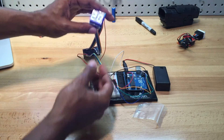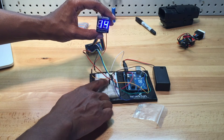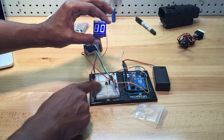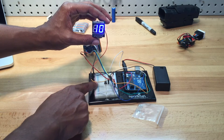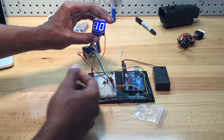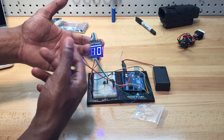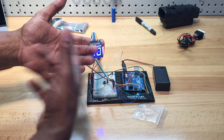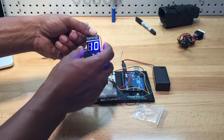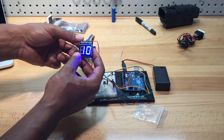This one is wired up, set to 20, and wired up to this button just for demo purposes. You can click the button and it'll go down. You can also set reset buttons to reset to 20 or whichever number you're counting. You can put in switches to change the count from 6 to 12 to 18 to 20 to 25 to 35, which are most of the ranges that Nerf bullets come in. You can use two IR beams so that once you load your darts in, you can automatically count each one while loading — that would be for the Zeus. A couple of people want to use this on their Nerf Rival guns, and two IR beams would be optimal there.